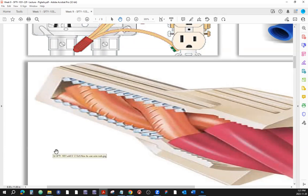Now, some of us were struggling because the wire twist-on connectors are being used and reused and so on. In some cases, we have seen that metal insert where the thread is fall out. You could keep twisting it, hoping that the thread is going to grab, but this thing just keeps twisting and nothing is grabbing anything because the thread has fallen out. That insert can fall out. All right. So make sure of that.